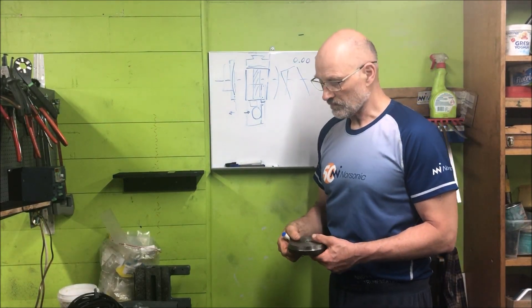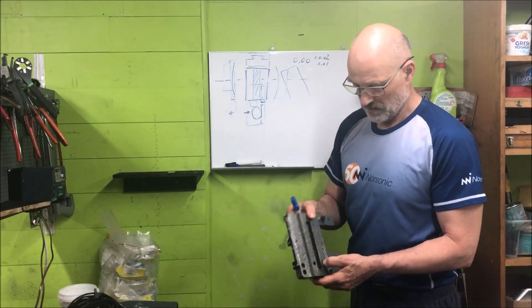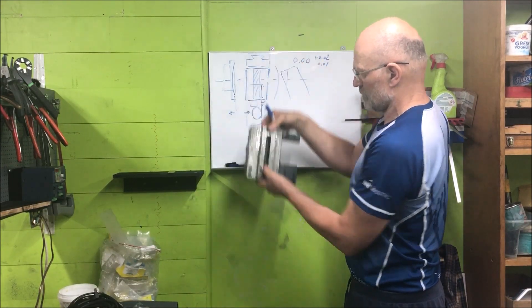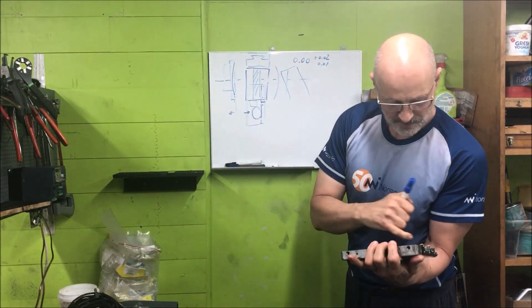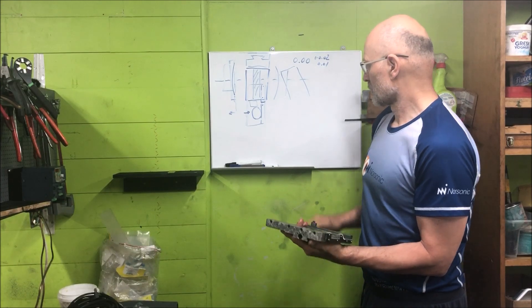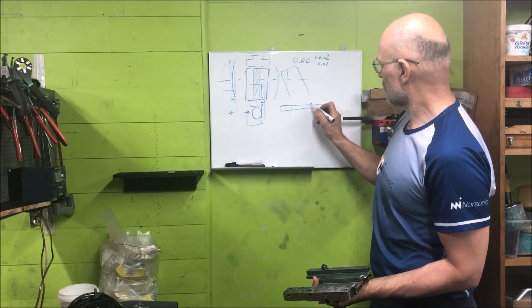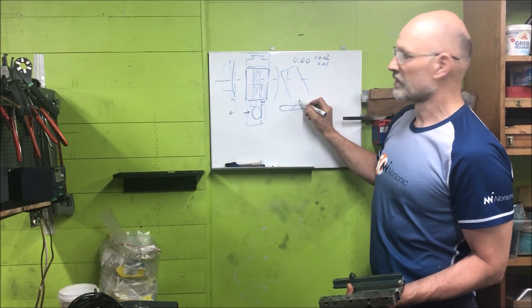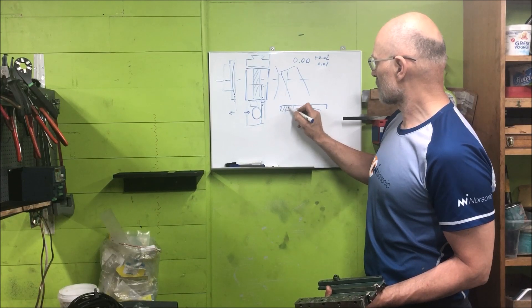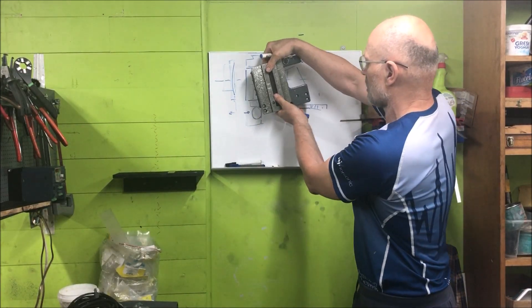This is normally half a thou or even less. The way I do this on a saddle is to take the rear guide and first of all divide it into three sections, because I know I can really relieve the middle. So I scrape the middle a little bit deeper, and then these are thrust pads which I can adjust this way or that way to make any kind of angle I want.